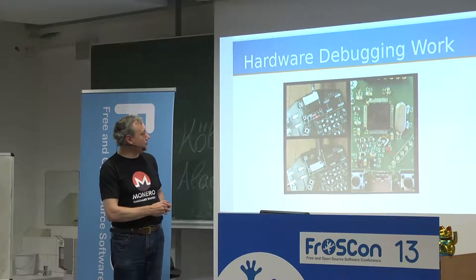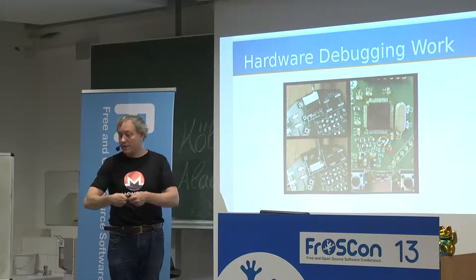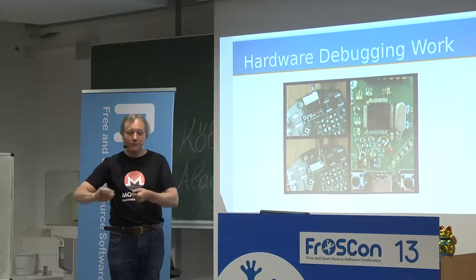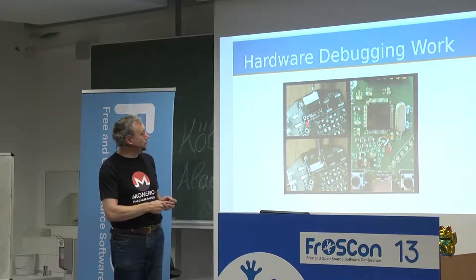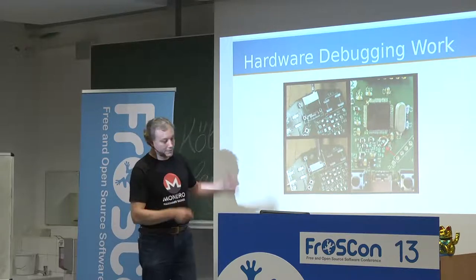We were not writing traces to the PCB in the correct manner, so we had to mask off half of them, which then meant that we could only put the USB-C cable in one way. Usually you can reverse the USB-C cable, and it's no problem because it simply uses the other contacts, but we didn't do a good job of that. So in debugging, we masked it off anyway.